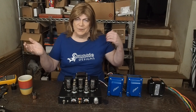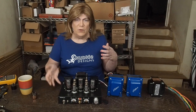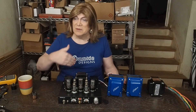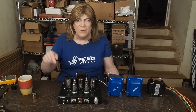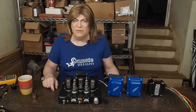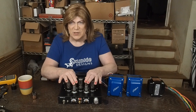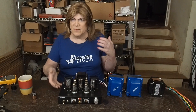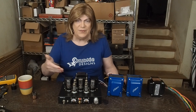I've had a little debate on Audio Karma about whether single-ended output tubes sound their best when run near the max. In my experience, they do. Every amp I've played with that didn't run the output tubes pretty hard had issues. Here's another example — I feel like what's holding this amp back is the power transformer is too weak to run these output tubes anywhere near their max dissipation values. And we're running into all kinds of weird asymmetrical, overdriven problems. I don't think this would be happening if the tubes were driven like I think they need to be driven.